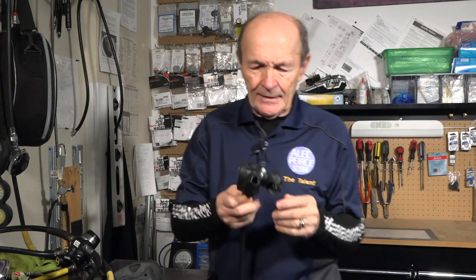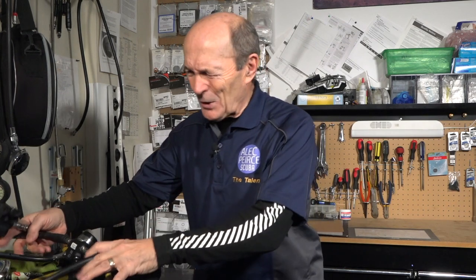These plastic regulators don't corrode and don't wear out. It used to be that after a few years you'd have to replace the body, face plate, or other parts because the chrome-plated brass would wear. These don't. There's lots of information on our tech tips on how to keep a modern regulator clean, which essentially comes down to soaking and cleaning it really well after every use — not once a year, after every use — because salt hardens on there and doesn't come off with just a rinse. However, older regulators didn't look like that.